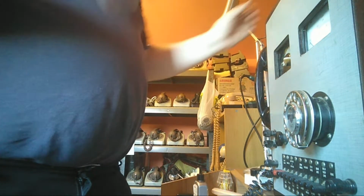Right, so I have to remember how to do it. So there's a phone on top of it. A 300 series phone is now sitting on top of it. There you see. So that phone is on an extension, and I think it's on 27. So what I have to do now is, I'm not testing the line here. I'm testing into the exchange, because this box, where it wires up into a telephone exchange, what this one's actually wired into is a little PBX unit down here. You see? Can you see that?